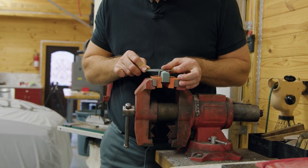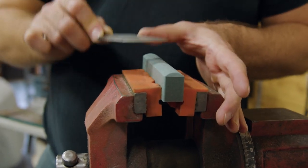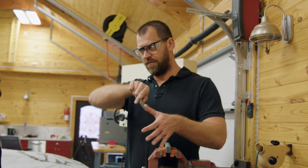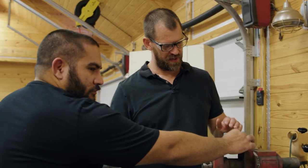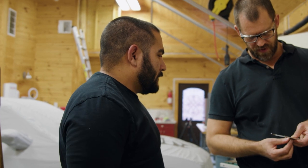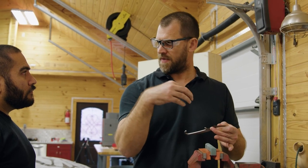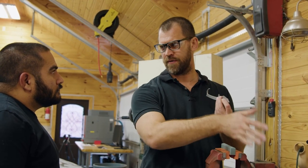You can come in on this one here. Be careful with the tip because it's so easy to keep chasing and then lift your hand as the knife comes off the stone — that'll roll the corner. I learned this with belts because you pull the knife off the belt and you roll the tips very easily. For this 220-grit stone, you'd want to then go to a higher grit — create that edge and you can play: do an aggressive 220 on one side and a 1000 on the back, giving you micro-teeth.